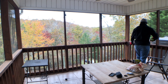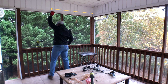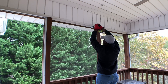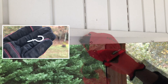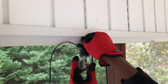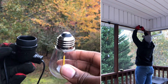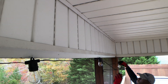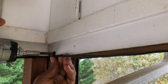The length of the string lights I ordered were not long enough to wrap around my entire deck, so I decided to find the midpoint of the deck so the LED string lights started and ended in roughly the same spot on the left and right side. After finding my starting point, I used a small drill bit to make pilot holes for the cup hooks that the LED lights would hang from. Once the first LED string light was attached, the rest of the process went by fairly quickly since I no longer needed to measure anything. Another feature I like about this type of LED string light set is that the bulbs can be replaced if one ever fails. After all the string lights were attached to the hooks, I went back and secured the parts of the cable that were hanging to give the overall look a neat appearance.